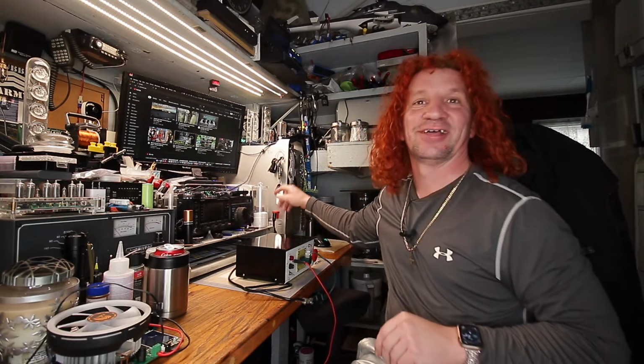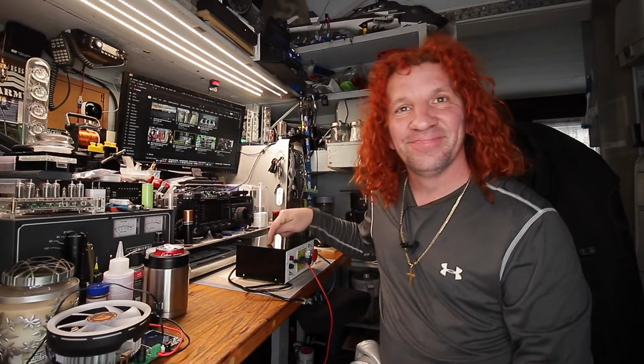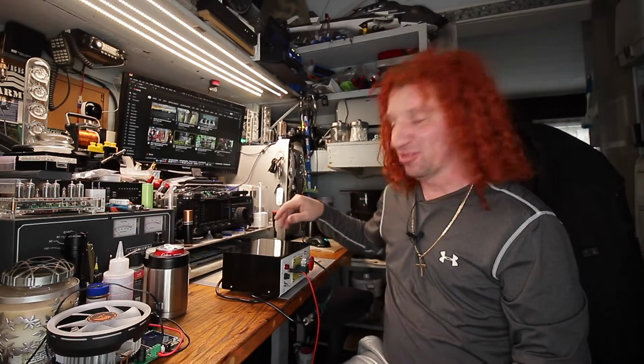And that Lightkeeper Pro is an igniter for a butane lighter. A butane lighter has that clicker in there, and that thing has a couple of diodes in it, so that each time you jump it, all that high voltage from that igniter goes out, and it kind of gets doubled. I think there's a couple of diodes in there, and it multiplies the voltage a little bit. So you get a couple of, I don't know how many, hundreds of volts or thousands of volts that go and zaps that shunt. So something in this box should be similar. We should be having something in here that sends out high voltage.